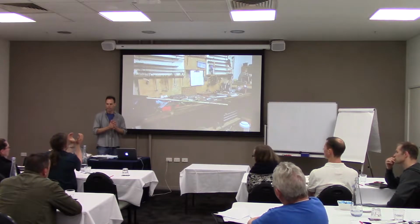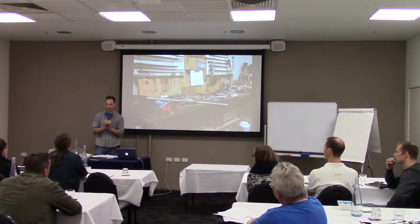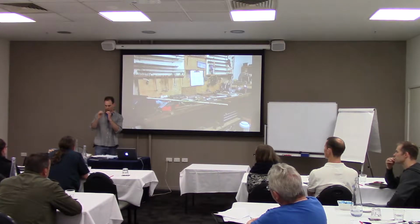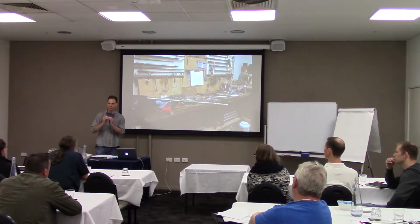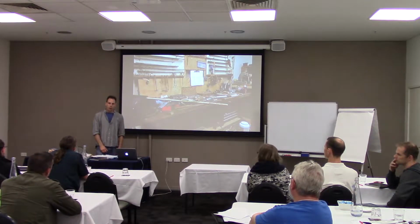So with, you solder it sometimes when it's like a V like that. So the top is kind of heart-like shape almost. And then it's going to make it easier because now this is going to be re-annealed at this point, so it's going to move pretty easily for you. But again, try to keep it out of the inside as much as possible because that's a bear getting it out. Do you spend a lot of time cleaning up the edges after the shear marks?